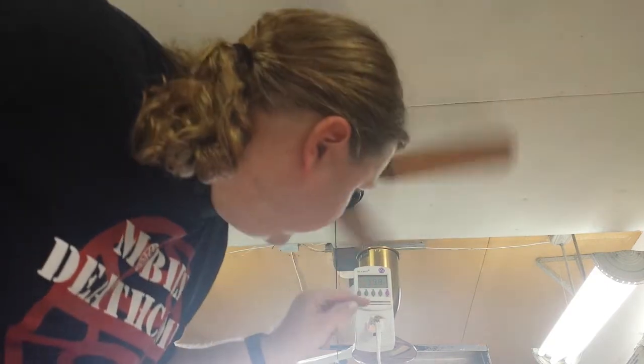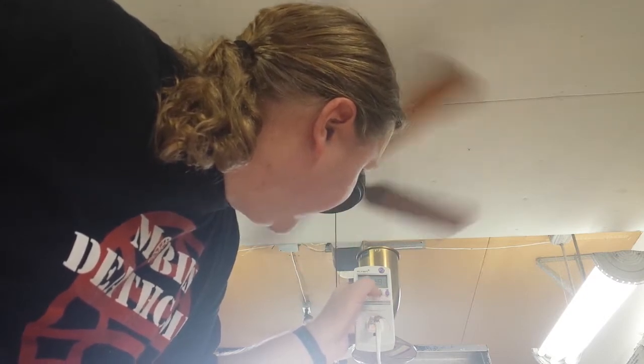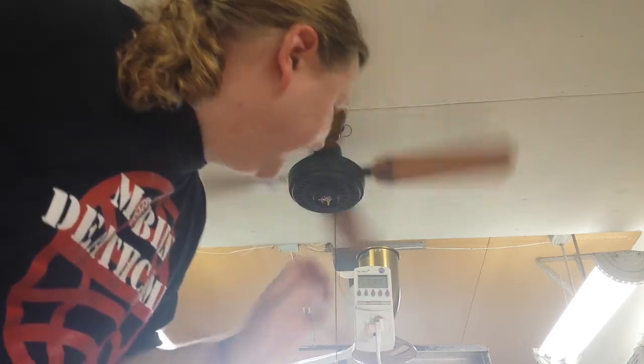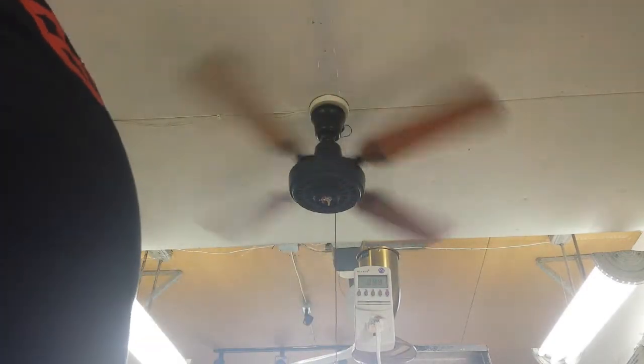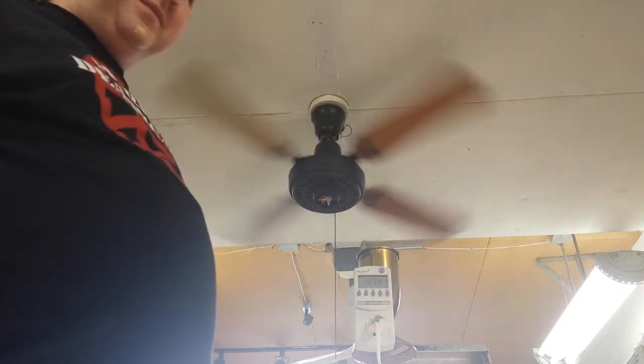Is there a button for power factor? Oh, right down here, I think. Sometimes you may... What does it hit? Hertz? Yeah. So hit Hertz first. That's 60 Hertz, and then the power factor is 0.98. Yes, that's really close to what you're saying. And it is right at 60 Hertz, which it should be. Current from the supply is supposed to be 120 on the nose and 60 Hertz on the nose, but sometimes it fluctuates. Okay, so go back to amp.